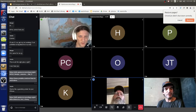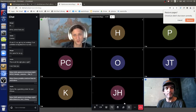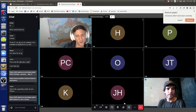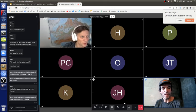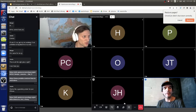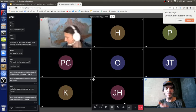The idea behind this kind of merge workflow: if you try to scale it to many parts being done at the same time with a large team, you cannot really lock down files. Our philosophy here is check what the latest upload is in a part library. You've got the authority. As long as you check, you download the latest one, you know you're working with the latest one. The rule here is as soon as you have some progress, upload it.